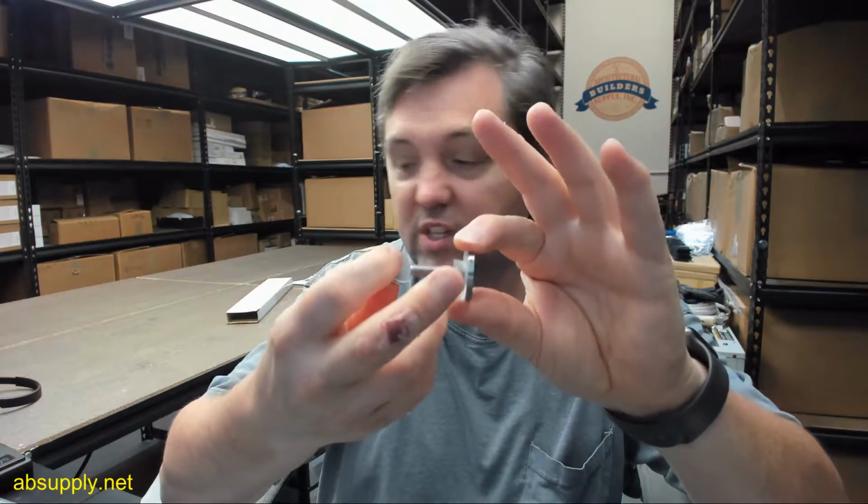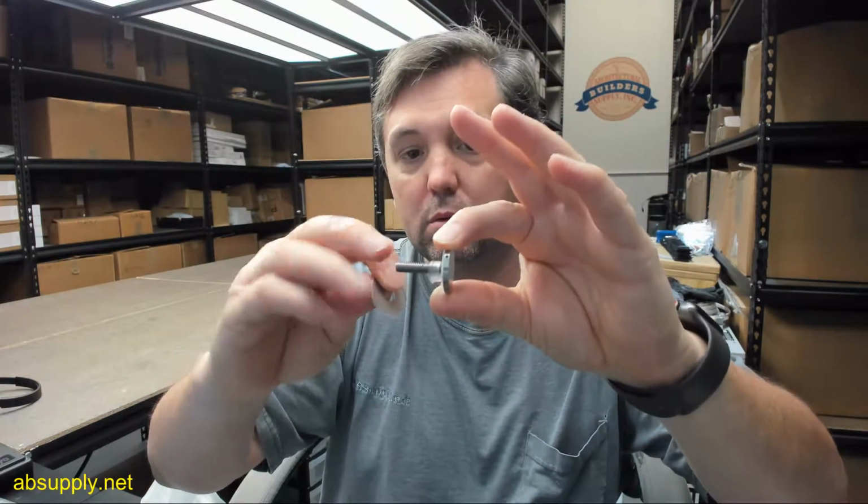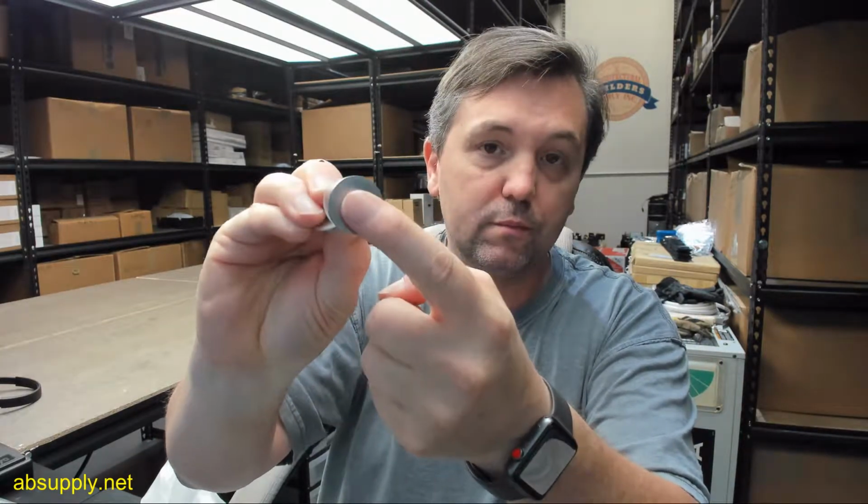Now with this, and again, you're going to get a pair of them, obviously one for each end, it's going to be comprised of the metal washer that will seat underneath your bar. It will go with the plastic washer that will go underneath, so you're not making contact of metal down onto glass. You're going to have your bushing for the standard half-inch hole, another washer, and then a larger nut or decorative cap for the interior or opposite side.